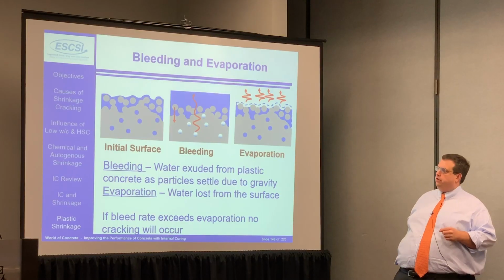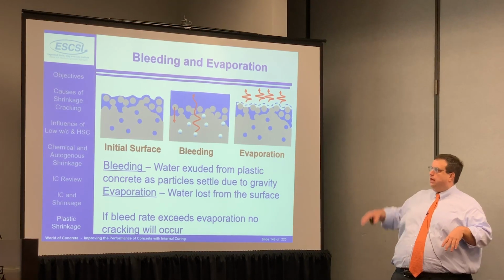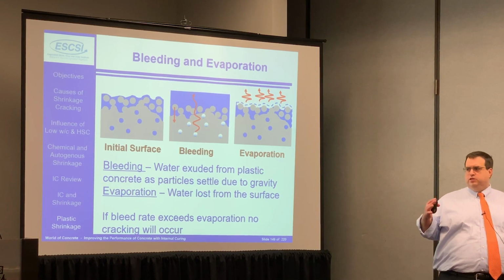Let's talk about evaporation first. You know, the whole idea here is we know that we place our concrete initially, and then a lot of times people talk about the fact that you get bleed water, which is water rising up out of the concrete, and it sounds very space age and biblical or something. Things are rising and it's very exciting. The water isn't rising at all. Gravity is affecting everything in the system. It's just that gravity brings everything else down a whole lot faster, right? So the aggregates sink faster, the cement sinks faster, and water kind of gets exuded and it stays up at the top of the system.